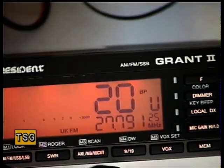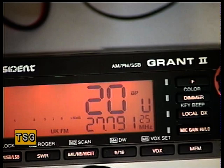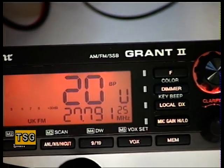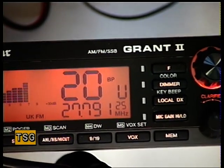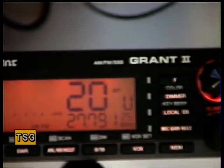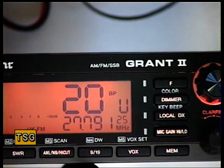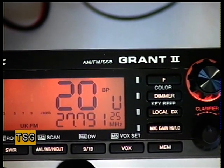I can't do any tests with the sideband because we don't have the right test set here at present. We'll switch the signal generator off, set the squelch to full, then put the signal generator back on. It's coming in at plus 30, so that's acceptable. We'll just check the sensitivity for minimum squelch — that sets the threshold on the radio. Signal generator on, and it's back off at 0.3 — there it is. Good hysteresis.